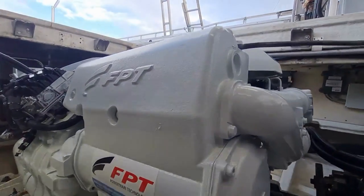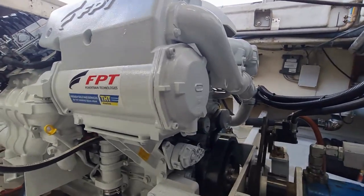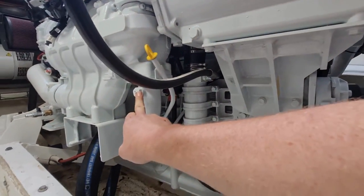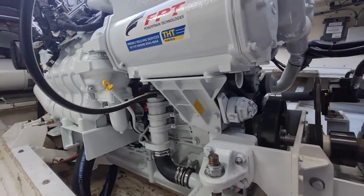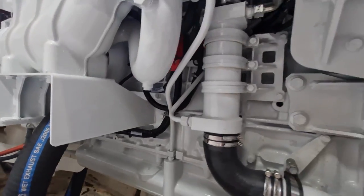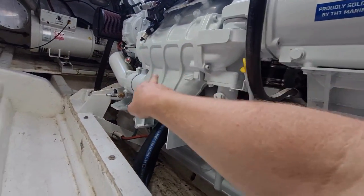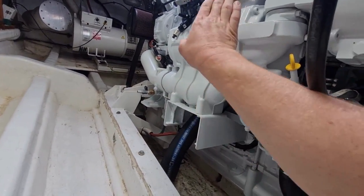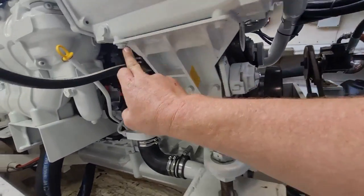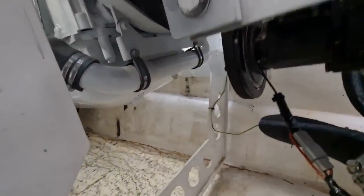We have the heat exchanger with coolant in the top header tank here. Beneath is the tube stack for seawater flow. We have sacrificial anodes front and rear, and the bronze impeller seawater pumps are tucked up underneath — they do not require regular maintenance. From there the seawater goes straight through into the intercooler, with the boost pipe coming across and up into the intake manifold, then through the cooler and back down through the fuel cooler before routing around underneath the engine.